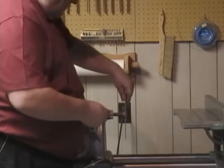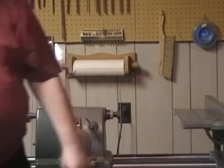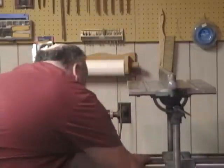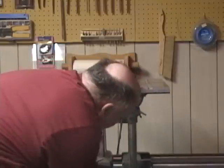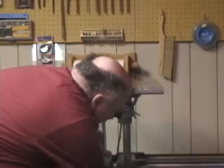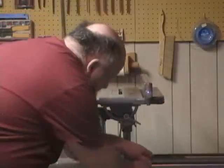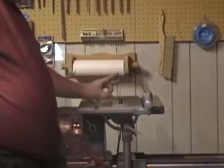Saw blade. Same Allen key — saw blade is on. Slide the table in, raise the table up, slide it over the blade. There's a set screw down between the two units that lets you fine-tune the blade, but when they butt together you lock in the table. Then you lower the table down using the table height adjustment, and now you have a table saw.